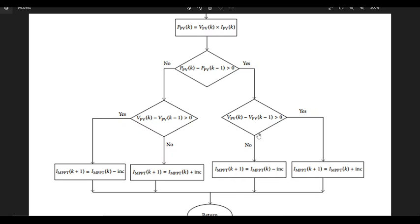And to actually use the charge controller routine, you have to ask yourself, okay, this is happening, but that's on the input. What's happening on the output in this particular scenario? That will determine whether you increase or decrease your PWM, because that's what happens in the end anyway. You either increase or decrease your PWM. So what's happening on the input versus what's happening on the output varies with each converter. The boost is different from the buck, is different from the Cuk, is different from the flyback.